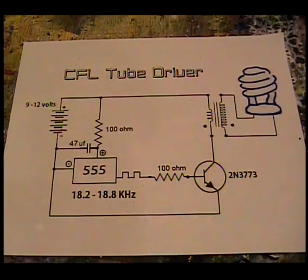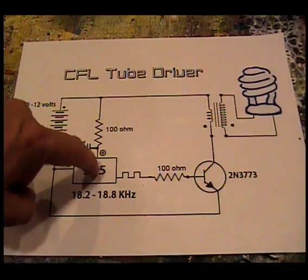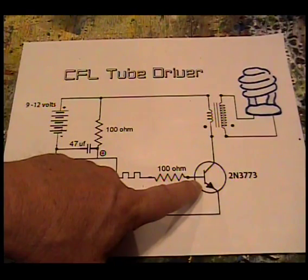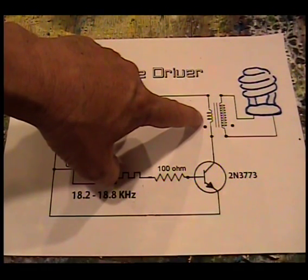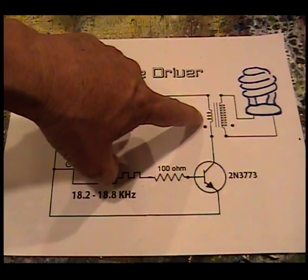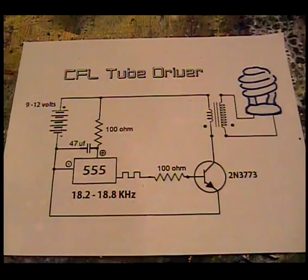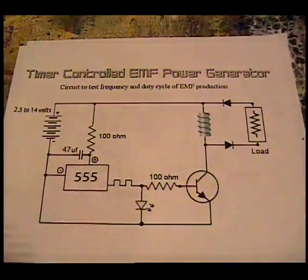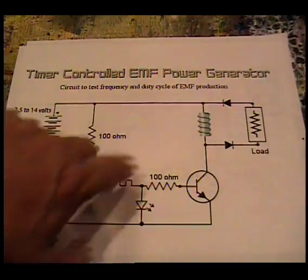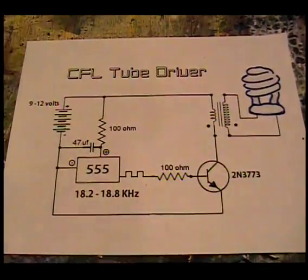This is quite like my other circuits. A 555 timer is going to send a square wave to a transistor. The transistor is a switch which will allow power from a battery pack to energize a primary on a standard homemade transformer — I made the transformer myself. This circuit is a little different than my usual. Usually I'm dealing with single inductors and creating electromagnetic flyback voltage. This is a transformer, not a single inductor. So duty cycle is going to be 50%, and I'm going to be altering the frequency to get that transformer to perform at peak efficiency.